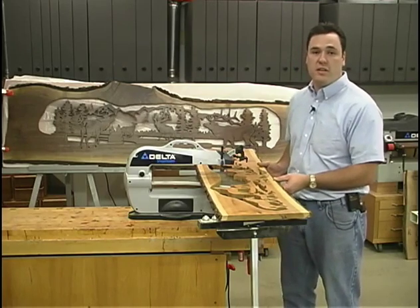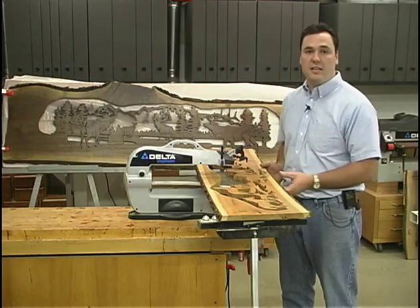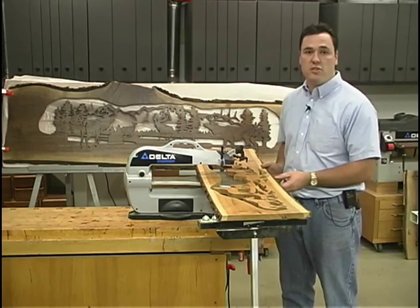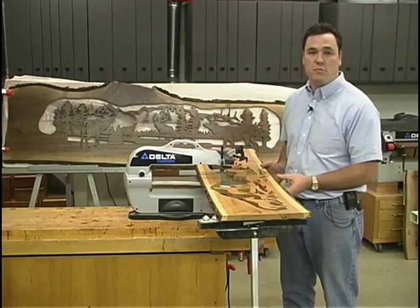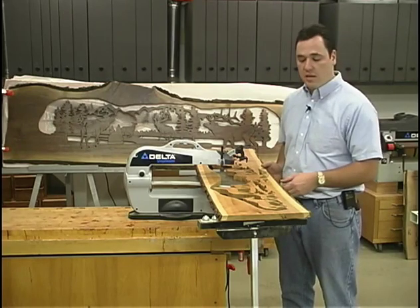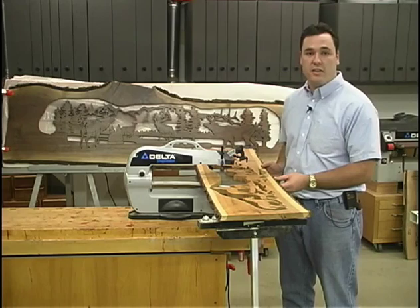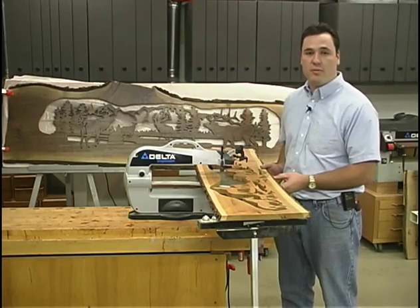Once your cutting is complete, the next final stage is to take your pattern off. Use a palm sander with 220 grit paper and lightly sand off the areas — be very careful in delicate areas that you don't want to break. You're essentially trying to remove any excess adhesive that may be stuck to it. From there, all my cuttings get sprayed with catalyzed lacquer — you can use any finish of your choice. I keep everything a natural color so I don't use any stains, pigments, or dyes, which would be hard to penetrate some of the smaller cutout areas. Then your next step is to find a new home for your cutting and enjoy it. You'll get an enormous amount of response from family and friends who come over and you tell them you did it on a delta 16-inch scroll saw. This is Joe Garza with Woodworking at Home — I appreciate your time and thank you.